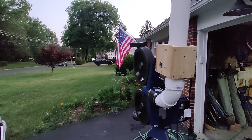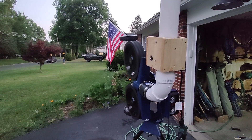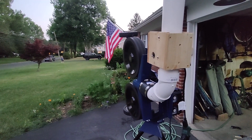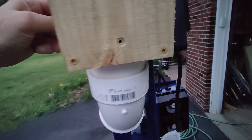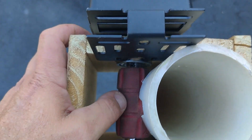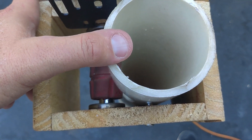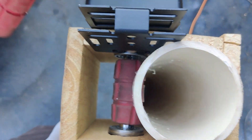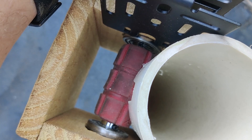It's going every about 12 to 15 seconds — I'm going to need to do some work on that. I had to modify it a little; it was binding up and going too slow, about 15 or 16 seconds between balls. I had to move it away a little more to prevent binding, but I also had to increase the diameter of the wheel. I had some old Oury mountain biking grips laying around, so I trimmed it down and slipped it over the existing rubber.